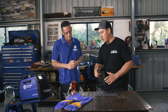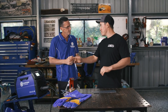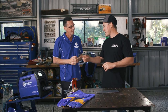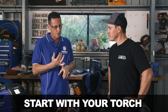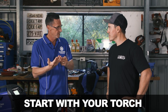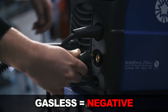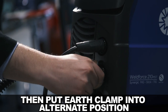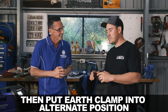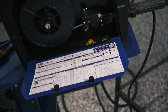Another big question is polarity. When you're welding you're completing a circuit — how do you know whether to have the torch on positive or negative when running gas or gasless? The easiest way: if you're using gas, the torch needs to be positive; if you're using gasless, it needs to be negative. Put your earth clamp into the alternate terminal. And if you get really stuck, just have a quick look inside the welder — there's a cheat sheet in there.